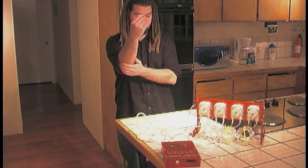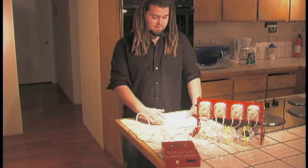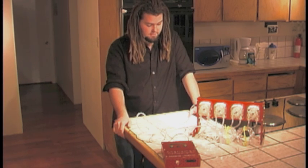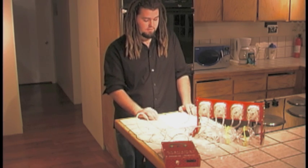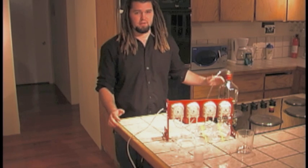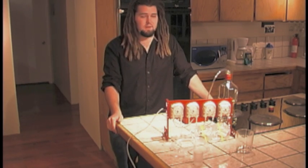Some nutrient brands use a different amount of nutrient based on which grow week cycle the plants are in. It's important to make sure that each week is checked and double checked to make sure the correct nutrient is being stored in the controller. Once stored, the values will be used by the controller to dose nutrients. In ounces, it will also do milliliters, teaspoons, tablespoons. You know, it's got all those different forms of measurement.